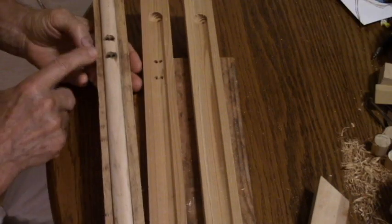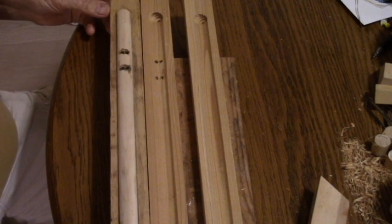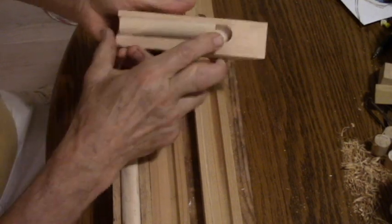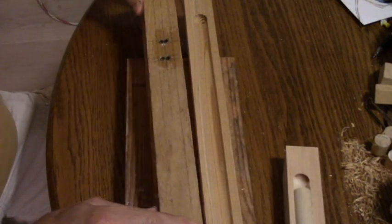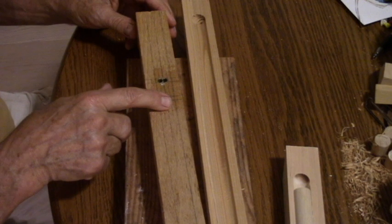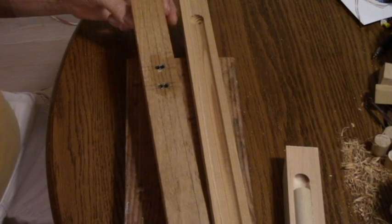So this drilling jig that I made, I used a block similar, and I ran it on my router table and cut the same groove, and then I just took a 3/4 inch dowel, inserted that in here, and similar to this. But this one is glued in. Okay, then the holes that I drilled, I lined with brass tubes. And the reason for that is when you use this repeatedly, the drill bit is not gouging out the hole in the wood, making it larger.